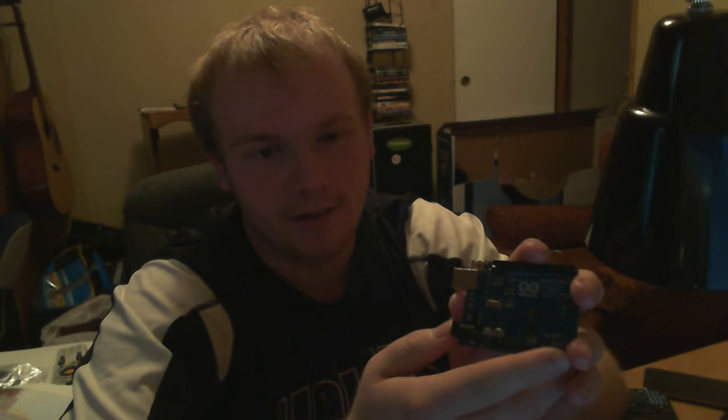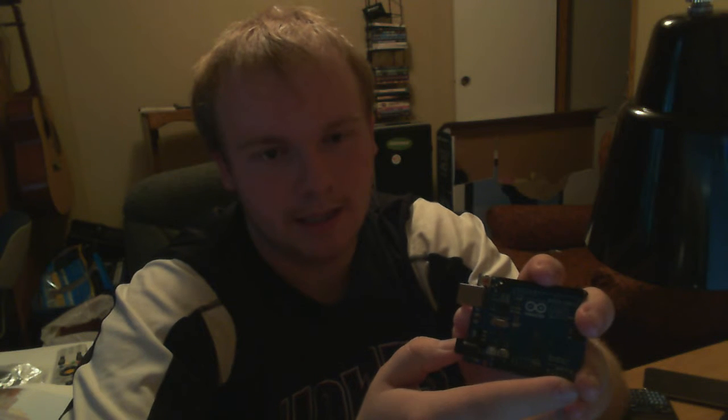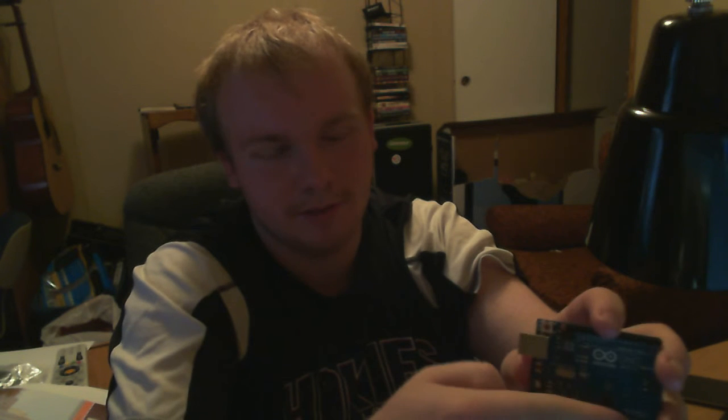If you look at the Arduino down towards the bottom here, you have analog pins. They are called A0 through A5, I believe. It's 6 of them. The importance of these pins is they allow analog input. They allow input values from 0 to 1023 on the Arduino. That's the range of values that come into the analog input ports when you're programming.